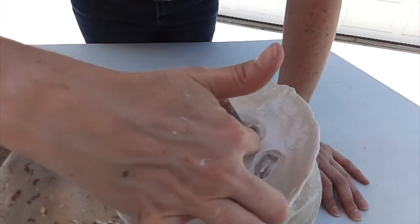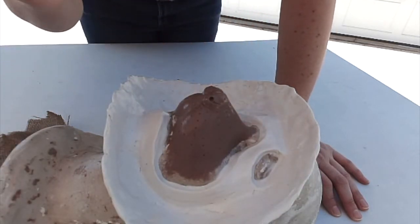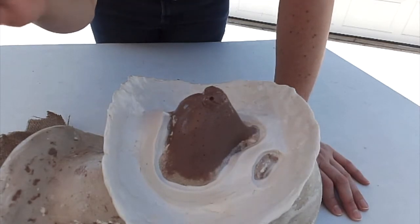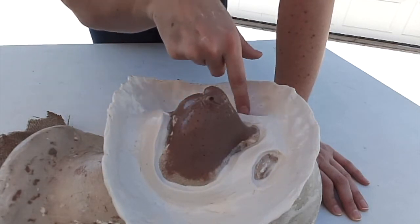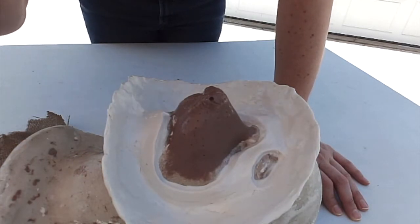a cutting edge around the whole outside of the prosthetic, and that's going to create an edge that will help to pull away any excess gelatin from the prosthetic. It'll help cut the prosthetic away from the excess gelatin. I've also created keys at the top, and that helps the negative mold fit together into the positive mold better.